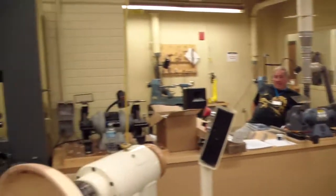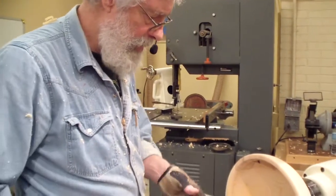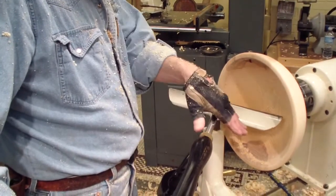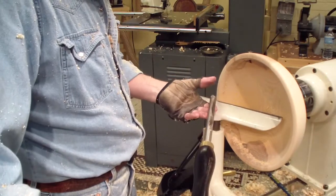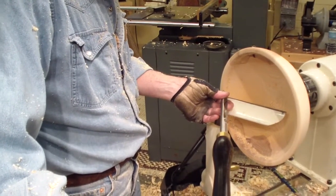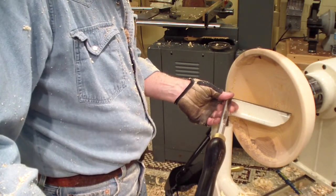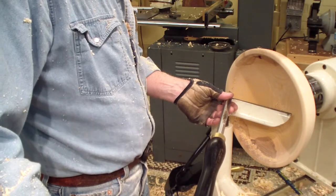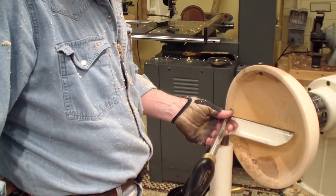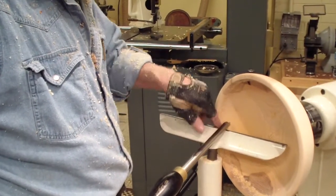Okay, now, up to this point, I've maintained the gouge in the horizontal position here with a 45 degrees across there, and that put me on the right-hand side of the radius of the tip, and that allows me to get safely inside that rim. However, now I want to put a finish surface on this bowl in anticipation of sanding it, so I don't use the roughing cut like this. It's too aggressive.